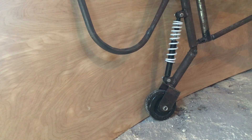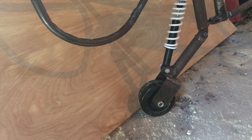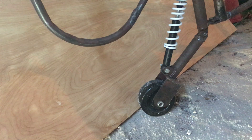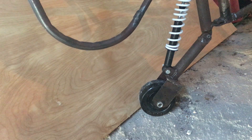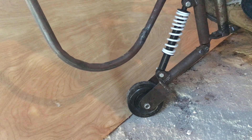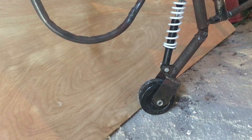It's 6 inches in diameter and 2 inches wide, so hopefully I won't have any sinking problems. One thing that's really unusual about the SE-5A's tail skid is that it was actually steerable, which gave the SE-5A really pleasant ground handling in comparison to other World War I planes. When I was building the tail wheel, I was really nervous that the spring rate was wrong, but fortunately, now that I have it together, I think it's just about perfect. With really light loads, like me just pushing on it, it has a pretty decent amount of travel, and even with heavy loads, like when I stand on it, it also has a good amount of travel and it's not even close to bottoming out.